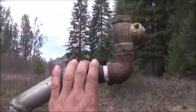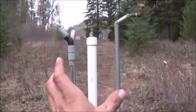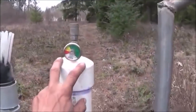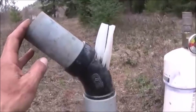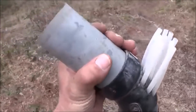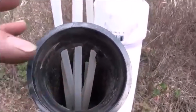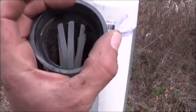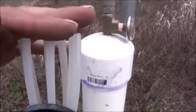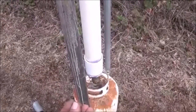To make a water ram work, this is going to have to be at least three feet lower than the head input on the side where we're getting our water source from. We're going to end up burying this whole system in the ground, cover that with some rust-inhibiting paint, bury it down in the ground, so this will just be sticking out about here. Now as water comes in from uphill, you can see here all our input straws — nine straws that are just hollow clear tubes running quite a ways down the pipe. When the water flow comes by, it's going to create a nice vacuum against those tubes, which will suck air into the tops and disperse that air as bubbles all the way down the pipe until it gets trapped down there in the Tromp tank system.